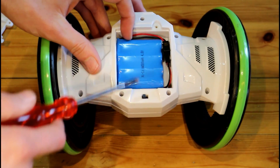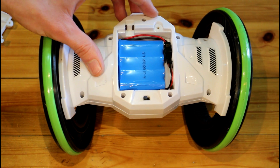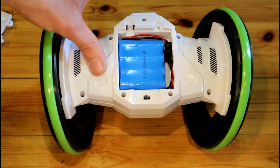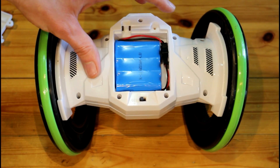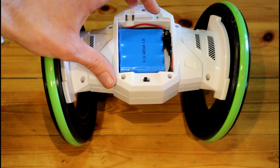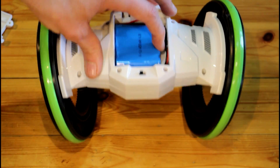As you would have seen in the review video, we have a 4.8 volt battery in this RC car, which is pretty ideal. You usually want around 5 volts for Arduinos and the ultrasonic sensor also expects 5 volts. The radio modules might expect 3.3 volts, so we'll just add a 3.3 volt regulator — not too big a deal. I'll be keeping the battery, the on/off switch, and obviously the motors. Let's continue with the disassembly.